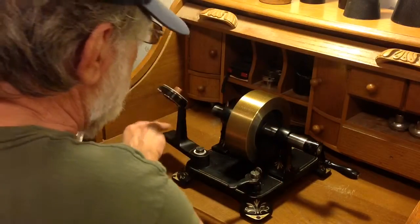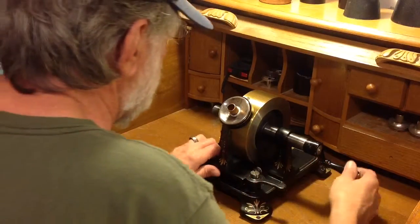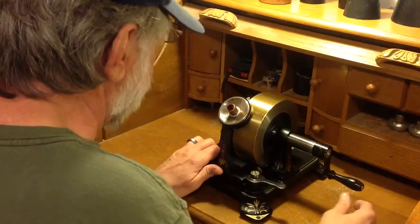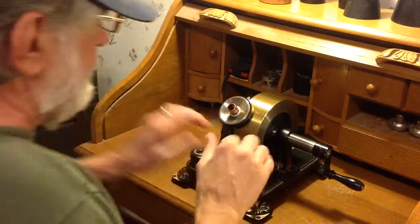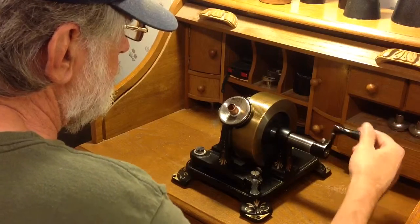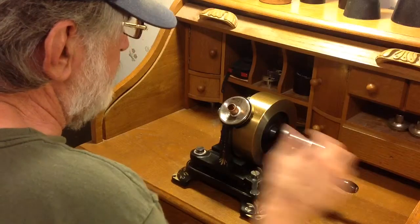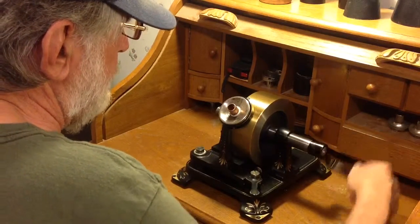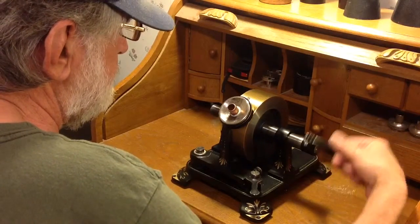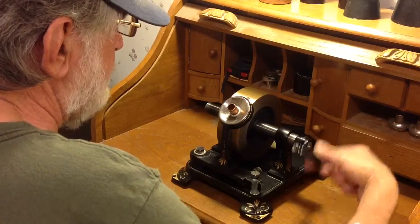Anyway, I just wanted to do a test recording to give you some idea of what I've done here. I adjusted the stylus so it is just in the center of the groove. Now as you hear it going across the mandrel, you'll hear it enter the first groove. Hear that? So now it's right in the center all the way across — you don't hear anything. It's not touching the sides, it's not touching the bottom of the groove. All the way across the mandrel is absolutely silent.